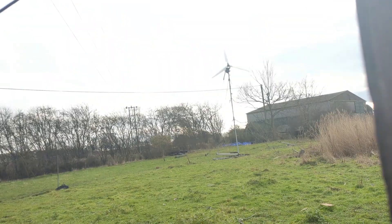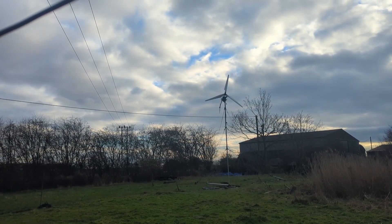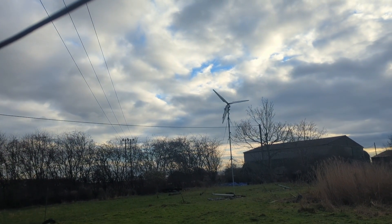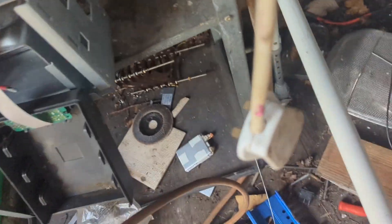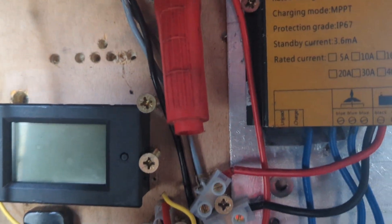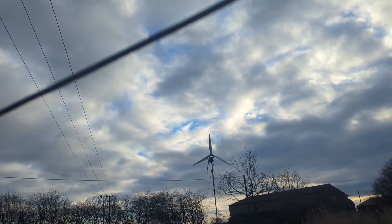That's it connected like that, the turbine doing that. If the turbine doesn't start spinning any faster I'll unplug the dump load and we'll see if it gets going properly. Let's just disconnect it a second. You'll notice the meter doesn't come on unless it's making about 7 volts. So it's been disconnected — let's see if it gets going any faster and importantly if the meter comes on.